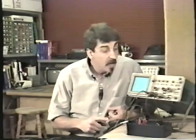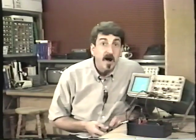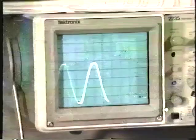And remember that oscilloscopes are not particularly accurate when it comes to measuring not only voltage, as I mentioned earlier, but also the period as well. And you end up saying, like I just did, well, it's about 3 divisions, a little bit more, and it's like 16 and a half, 16 and 3/4, somewhere in that range. And that's really as close as you ever have to get for our applications.